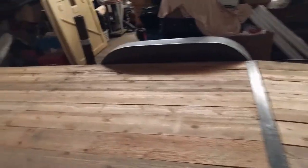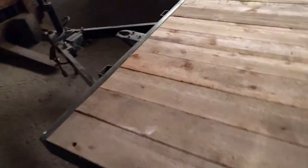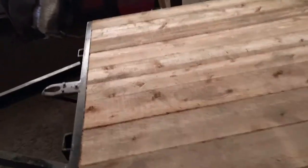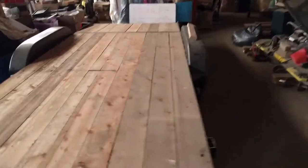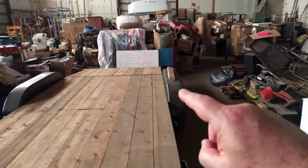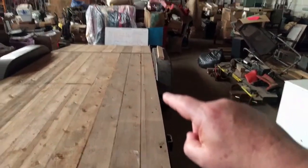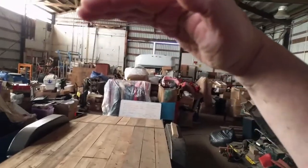I'll have a 16-foot home here, a little mini home. Now I can do the sides two ways. I can bring it out to eight feet just by building out a two-by-six floor and extending it another nine or ten inches on each side to give me a full eight-foot width. Or I could build a stub wall right here — a little short wall and build it out, then up, like an old-style vardo you'd see, but without the rounded vardo roof.